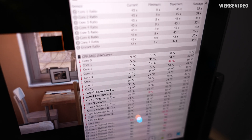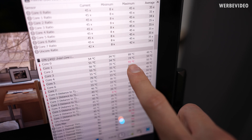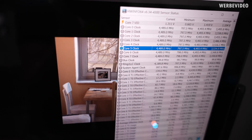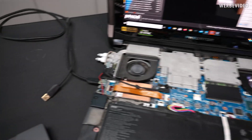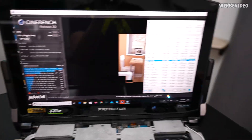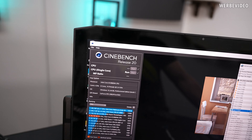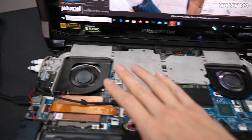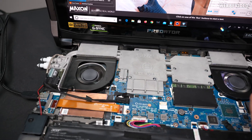The glossy display doesn't make it easier, but you can see the temperature is somewhere in the 60s. We had one quick peak at 90 degrees Celsius similar to what we had last time with the stock cooler, but now it's a quite decent temperature. The boost clock is always at about 4.5 GHz — right where it should be. That is a quite promising result. Stock performance in R20 single was 454 points — now it's 473, that is amazing. It's only 4% more than stock, but 4% is more than I expected, because our goal was just to maintain stock performance with the hybrid cooling solution. Getting a boost of 4% is quite awesome just for having the same kind of space and no additional surface area.